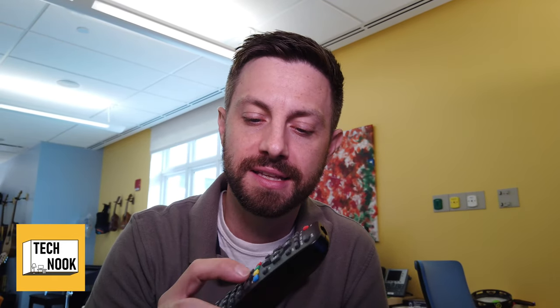Word of warning, TV remotes, terrible. Anything with these little soft kind of buttons, on the inside it's not going to be a hard switch. It's going to be this little flat piece of metal that then gets, the button is actually pressed by the rubber piece with something conductive on the bottom side. If it feels like a remote like this, that the buttons are soft, those never go well because solder doesn't stick to that stuff. I tried toy hacking a Nintendo Joy-Con remote. That was a bear. Broke it.